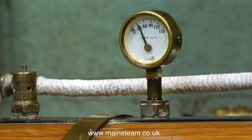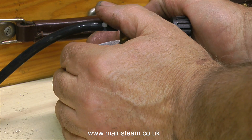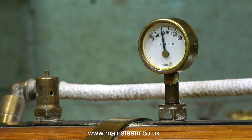This gas burner seems fine and the pressure is raising fairly quickly, but it's slowed down a bit — the tank is now very cold because as the liquid gas inside the tank is evaporating, the temperature of the gas and the tank drop rapidly. I used the heat from my hands to warm the tank, and in no time at all suddenly everything got better and the pressure increased.